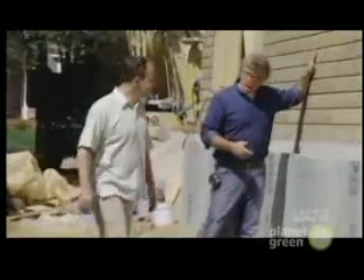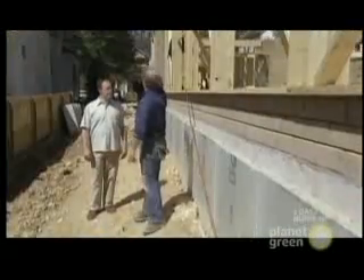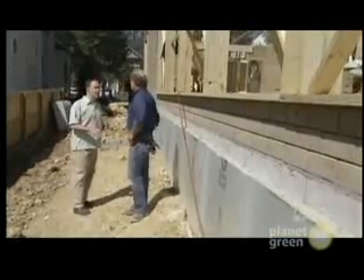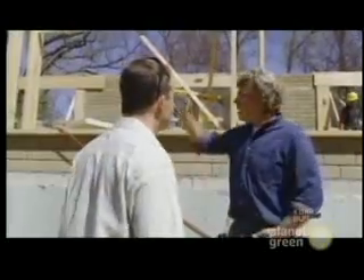Strength isn't the only advantage of these mud brick walls. Brian, part of the architectural team, explains that this house can be heated and cooled without any fossil fuel. This is south-facing — in winter, the sun tracks low and shines right into the building to heat it. Awnings and overhangs shade the house in summer to keep solar heat gain down. By venting the basement from the north side, cool air is pulled through the basement and out through high windows on the south side. These are tried-and-true technologies, though you still need insulation.